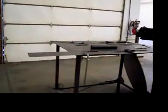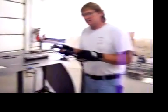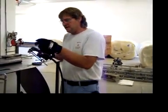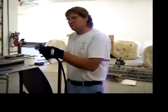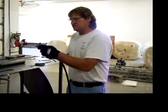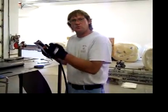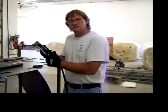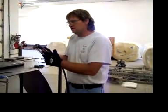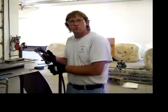I have already pre-center punched three different center punches in a small piece of plate. This allows me to cut radiuses and start and stop where I have the desire to start and stop each one of my cuts. I will now proceed, with this setting, to cut two different radius cuts and then I will reset and re-adjust the Ultimate Plasma Jig to make my third and final cut before we have my artwork complete.